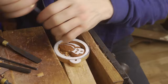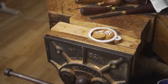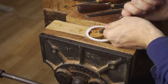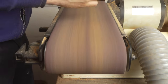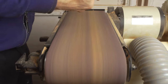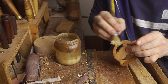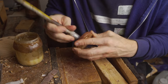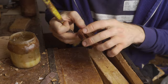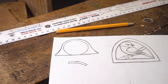Because we sit to carve, we do all of the carving in one direction first before turning it around in the vice and carving everything back in the opposite direction. The belt sander comes in useful once more, taking off any paper that remains and refining the finish, before the shellac sanding sealer brings up the colour and character in our owl themed hanging decoration.